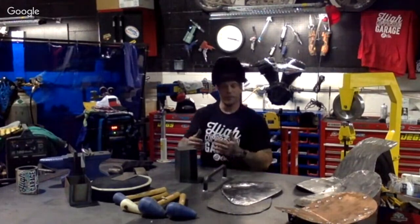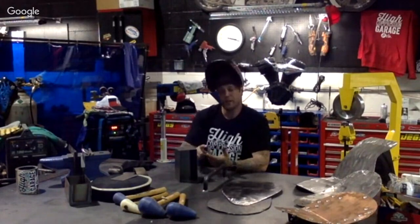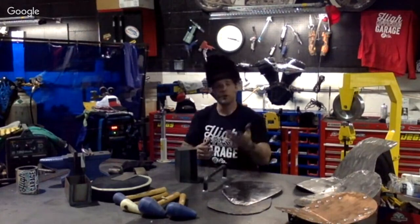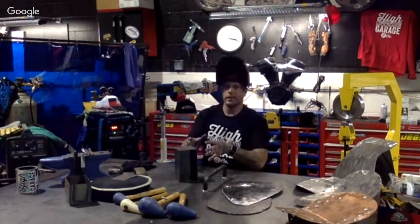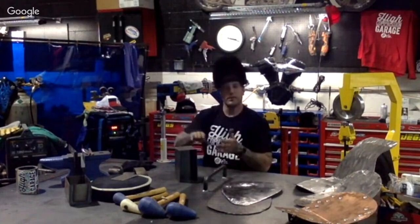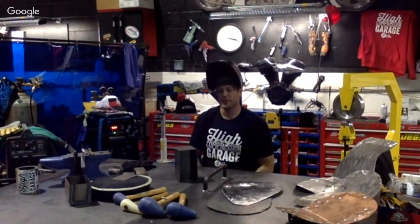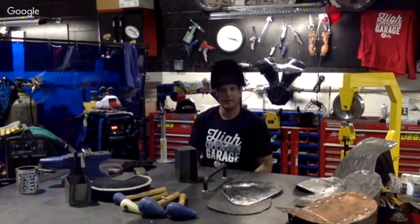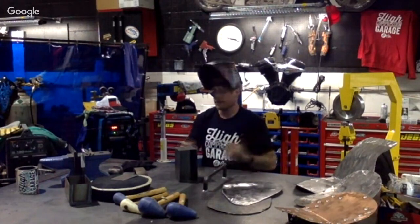And at the end of your piece that you're actually crafting, you want to make sure there's not any scoring marks, there's not any areas on there that would come through if you're getting the piece chrome, for instance, or powder coated. Reason being is that it's going to show right through. So what you're sending out is what you're going to get back. So if you see a big divot in there, fill it with your welder and grind that down to a smooth surface. I'm a perfectionist here, and everyone knows that I can be a little bit over the top on making sure every little detail is good, but in the long run, it pays off. So make sure the piece going out is the piece you want coming back.